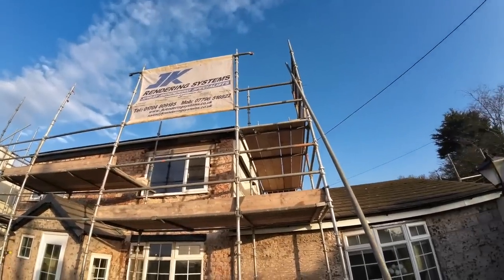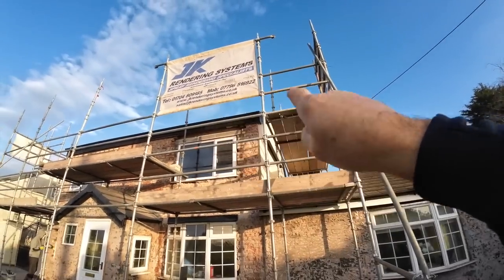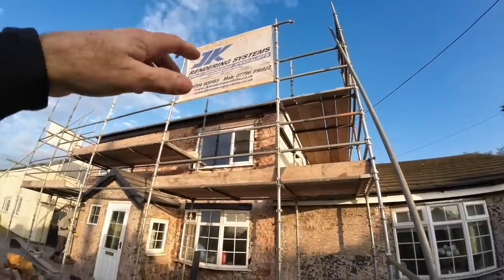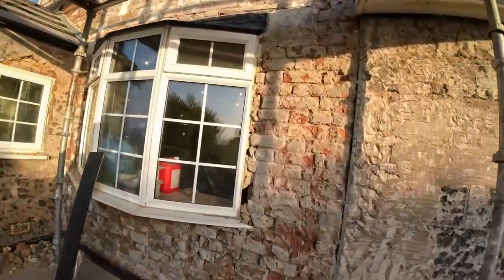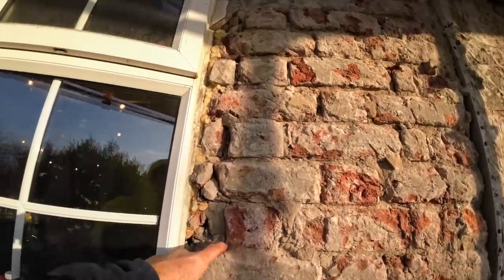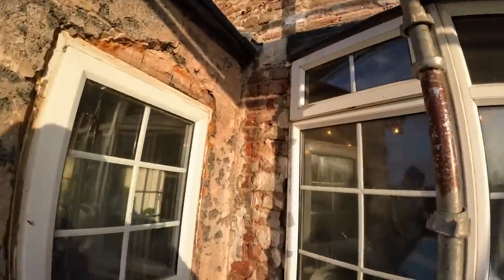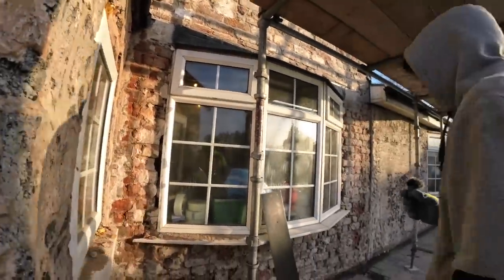But we managed to get all the patching done around the side. Did the whole side. That side's okay. And we got the lintel in, that bedded in. So that's ready for later. So instead of mixing and patching that up, we're prepping these two windows. Same again, taking all the foam out, taking all the little ones out, and then taking the odd one out to extend the toothing in so it's nice and strong. That one's not too bad, but it will need a bit of fettling, especially at the bottom.